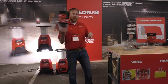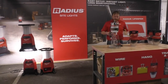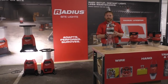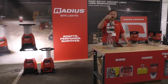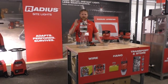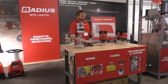Really setting the bar on size and performance, but what I really want to focus on is the actual process itself. These things are purchased by a pallet load and then immediately dropped off at the electrical contractor's prefab shop. These come out of the box wired for 120 volts with a standard plug. It's very common for these to get rewired for different voltages across the U.S. — anything from 120, 208, 277, really across the board. So everything gets unwired, rewired for a different voltage, packaged back up, and sent out to the job. We took a bit of a different approach.